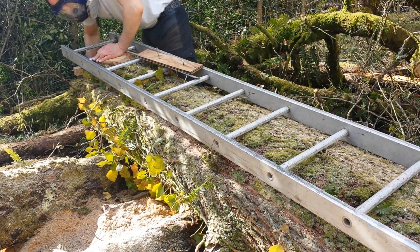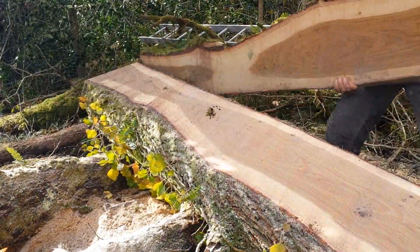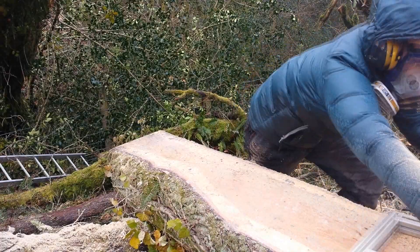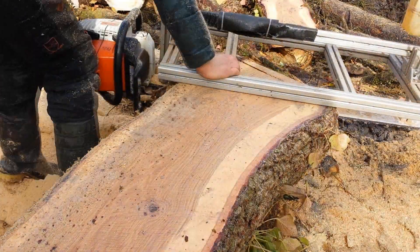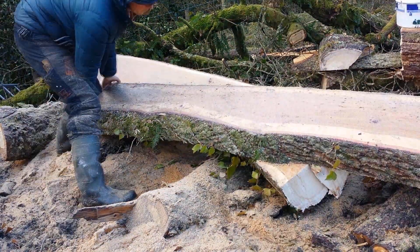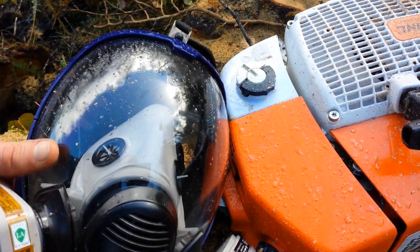With that first cut done it's a question of unfastening the screws, taking the ladder away and taking off that first slab. If you've been watching along, you'll know in the first tips video I made the argument that it's good to use the straight edge again even after you've created that reference edge — and clearly I didn't do that here. That's because sometimes I just don't follow my own good advice. In this case I wanted a nice thick cut so I could make a beam or beams from this piece, and it just happened conveniently that if I took the ladder off and went straight for it, the mill was all set up to the right depth of cut. Take a rag with you in case it rains.